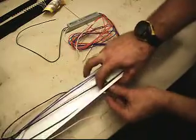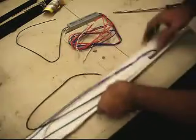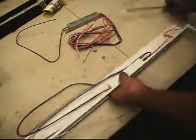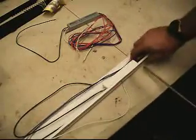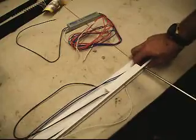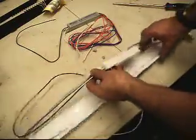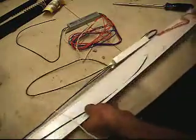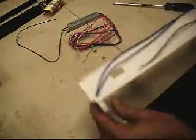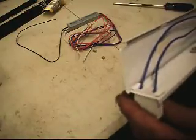There we go. I got the screw out. The nut came off. Usually you don't have to undo both sides. I'm just going to break the other side free just to loosen it. I'm not going to totally extract it. And the ballast itself will slide out and come up. This leaves me free now to wiggle the actual tombstones out of the ends.